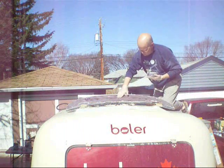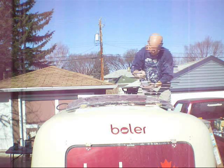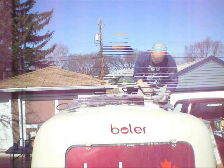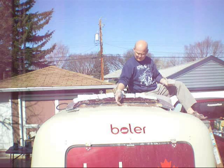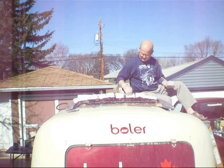I've lined this up and screwed it in. Now I'm just going to flip the fiberglass back over the top. I'll let this first layer dry and then I'll put another layer, attach it to this little space of fiberglass that I left and bring it right over and right down to the back. This will give you an idea of what the first layer looks like. I've still left some fiberglass here for the next layer to grip onto.